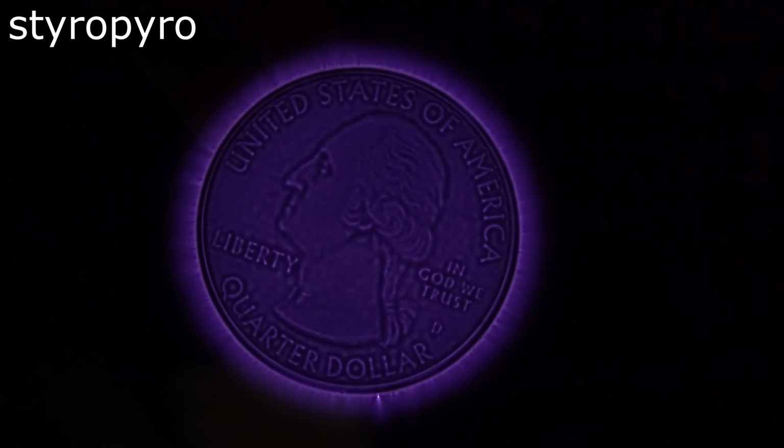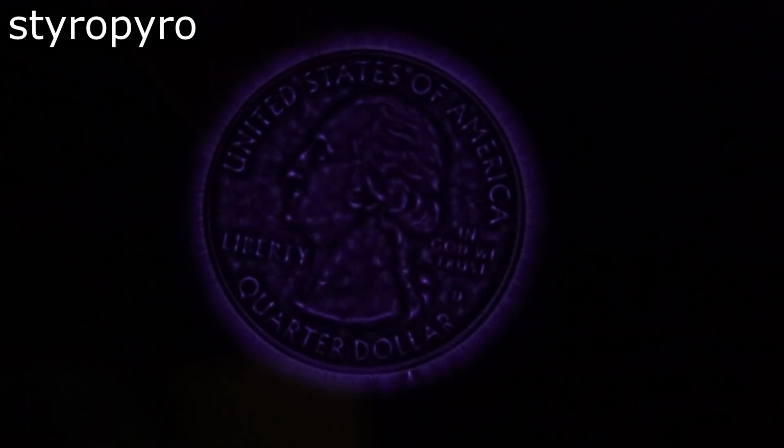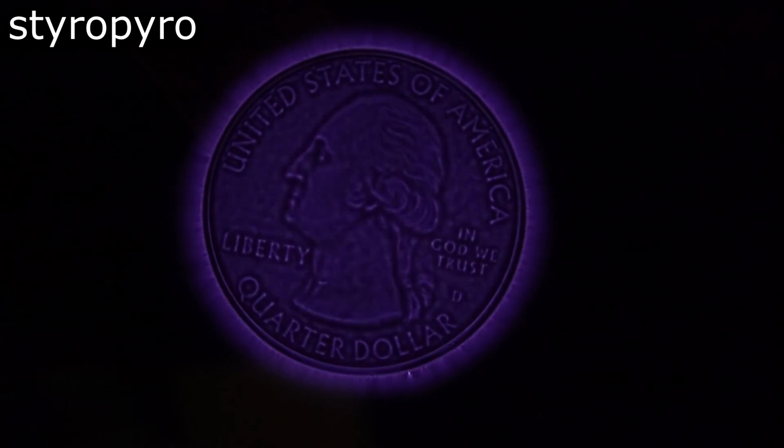Now in the past, similar setups were used to try to measure the aura coming off of a person, which now I know is just a bunch of pseudoscientific garbage, but you have to admit, it does make some pretty awesome effects. Now it's interesting, if I ramp the voltage here, you can see the corona slowly build up on the surface there and makes all those cool little sparkles. I can keep going and going, I don't want to blow out my transformers, and you get a nice glow coming off of there. And yeah, I can definitely smell the ozone from that. That's cool.